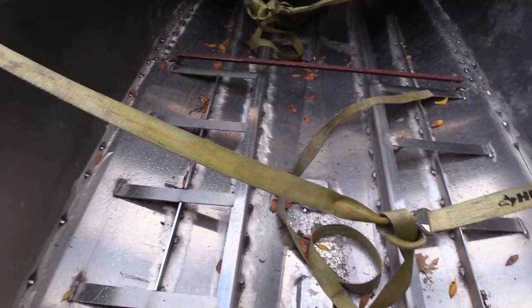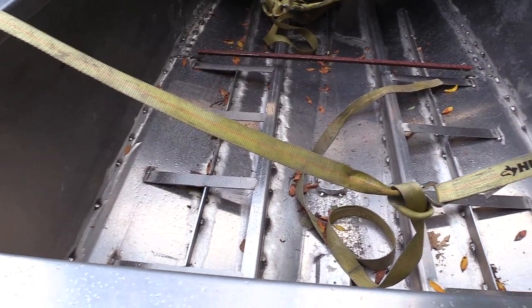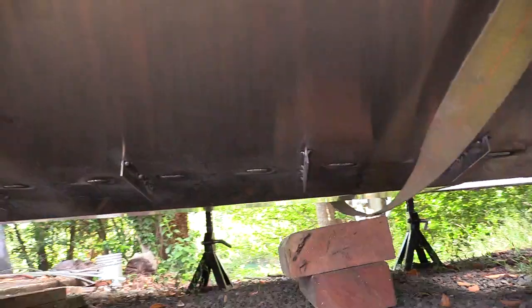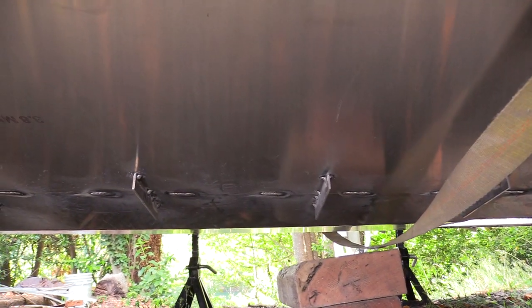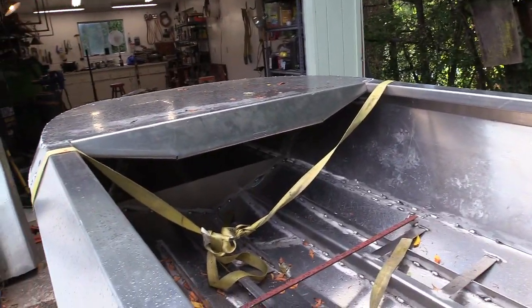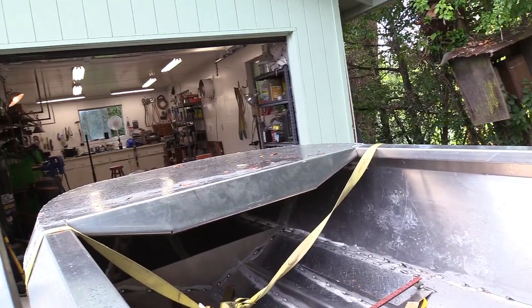But when you assemble this, your engine bearers aren't in here. You've got this upside down. You tack the outer hull plates to the keel, and when you do that, you're doing it with that flat bar on end to set the angle of the outer hull. So the back of the boat is square. The fab shop fixed that. In a previous video, I showed how the front of the keel is screwed. They weren't able to correct that.